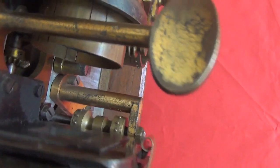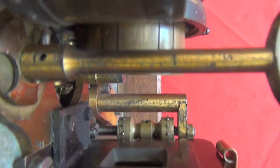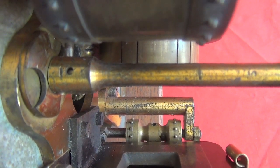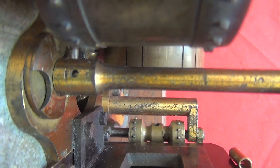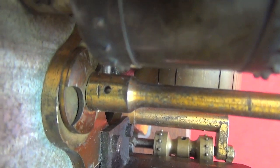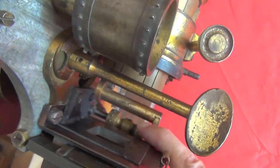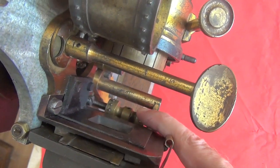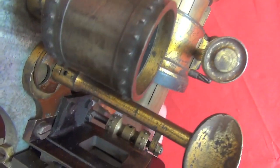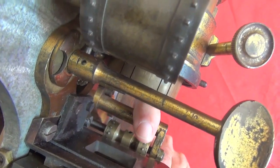If we look at the sprocket — it's tiny. Because three arms and four perforations per frame, three times four is twelve, so there are only twelve teeth on the sprocket. The smallest sprockets normally in use are for four-arm sprockets: four fours are sixteen, so there are sixteen teeth. So that's the smallest 35mm intermittent sprocket you'll ever see, because it's not possible to have fewer than three arms on the intermittent.